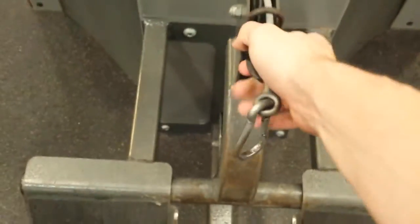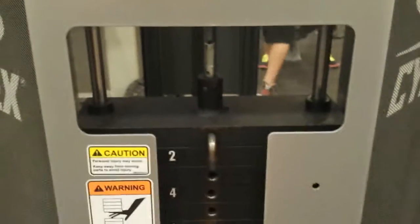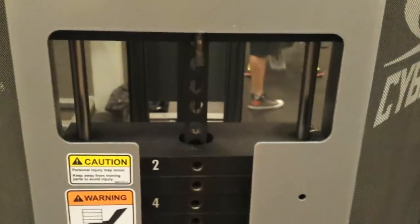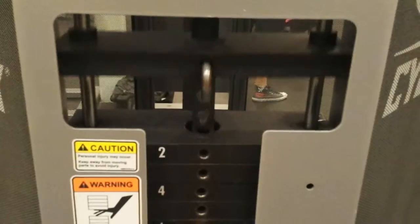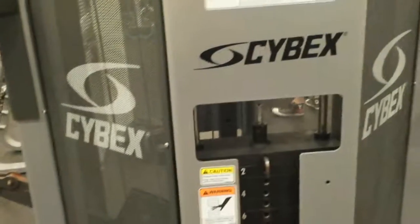So I pull it 6 inches, right? I'm going to pull the same amount, but look up here, 6 inches, boom. So you see it went up about 6 inches. So this is just redirecting the weight. The weight here is more or less, ignoring friction, the same here. So ponder that. Hopefully that helps.